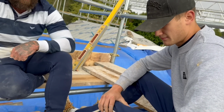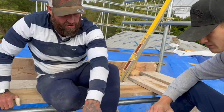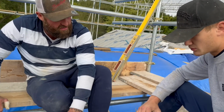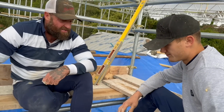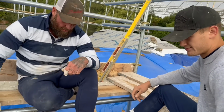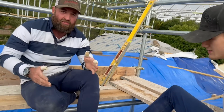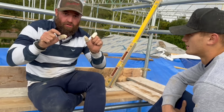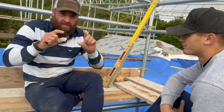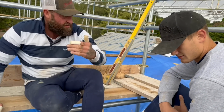So, on these returns, you're going to just do two stretchers. Yeah, then we'll cut the closures in after and point them in. That's it, because it's cost effective on the bricks. We're going to go two stretchers, once it's up. On the stretcher in the middle, he's going to cut two closure lines that will produce two closures in the header. So that's vertically from the roadside.